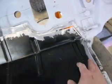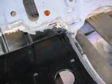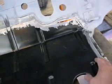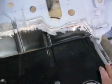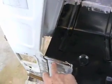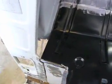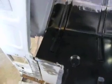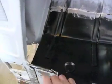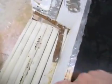And by making it flanged here, not only is it going to give it strength, it's going to allow me the extra floating space needed so this panel can shift this way or this way. Any way it needs to go, so this matches. The fact that it's sitting on this box is the same thing. It could float around here, here, here, to line this up, and it's not going to affect this. The same thing with here.